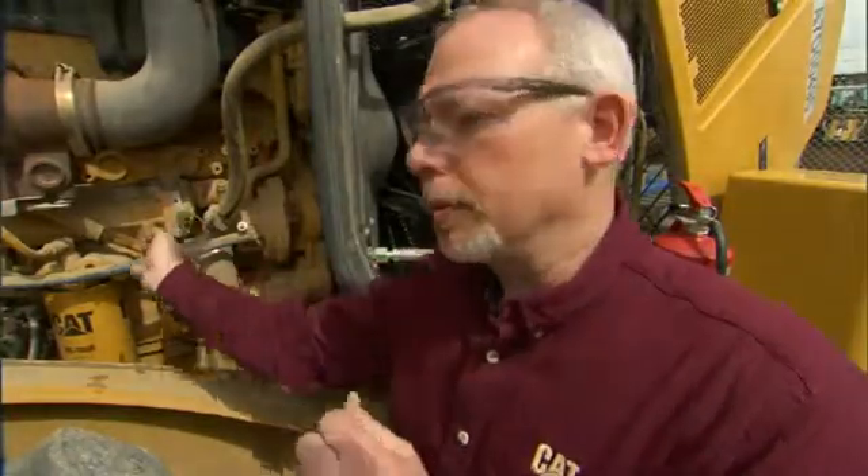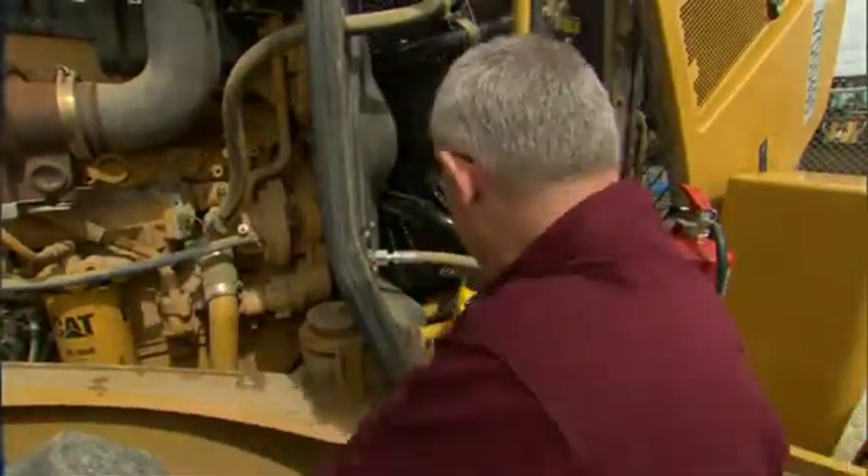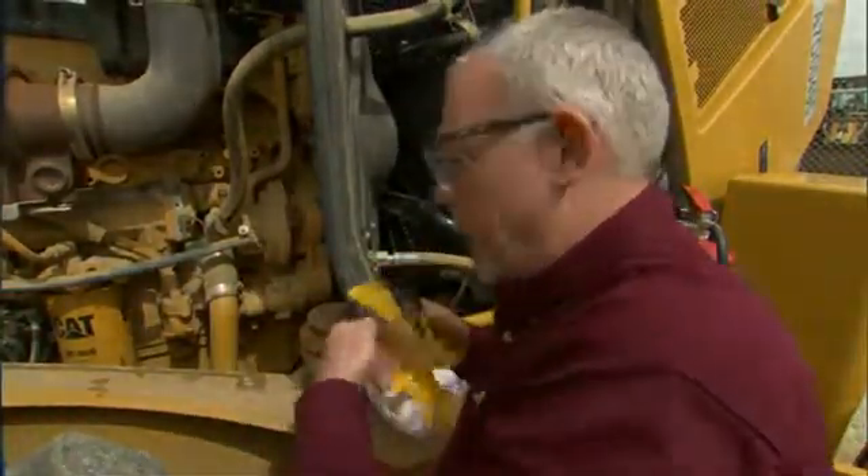Also, if you're doing one of these samples, you must make sure that your valve has that little hole in the end. If it doesn't have a hole, it's not an SOS sampling port. So what I'm going to do is make up a bottle.